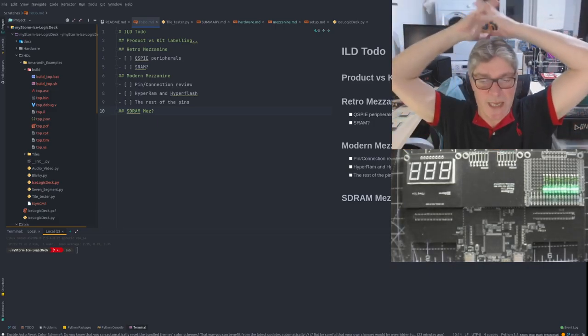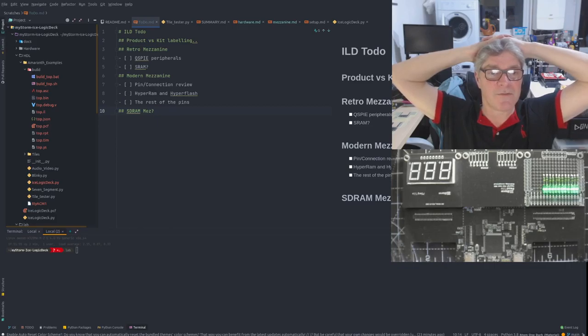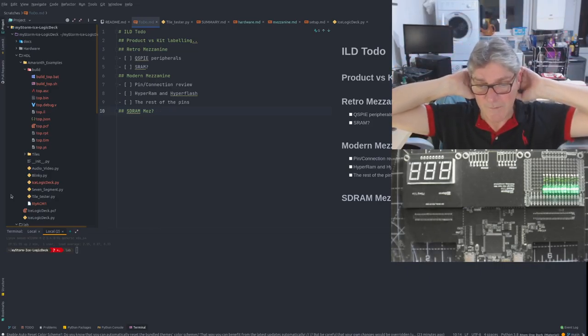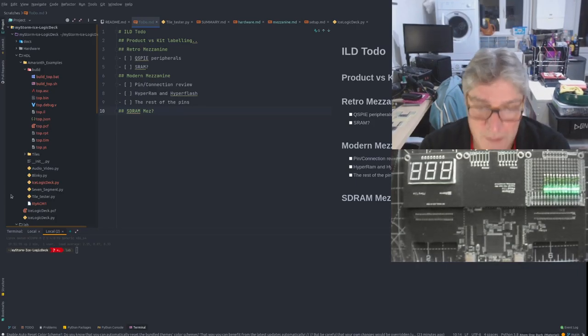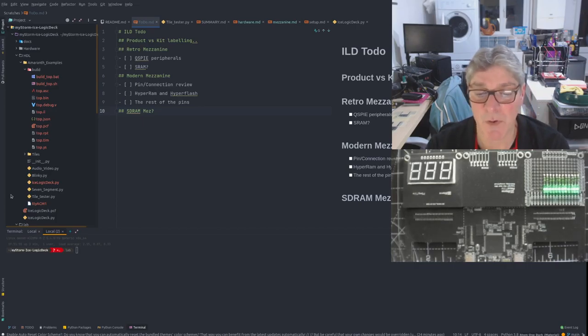I'm just trying to think. On the MX we had 16 megabit, which was 2 megabytes of SDRAM with an internal bank. That takes 36 pins, if I remember rightly. And for this one we've effectively got 37. So we would be able to add another line to that, and we'd have 2 banks, which would give us 32 megabits, which would be 4 megabytes. To answer your question, Laurie, it is possible,